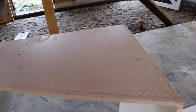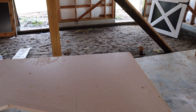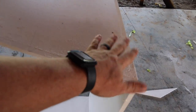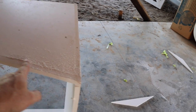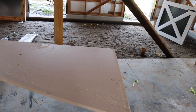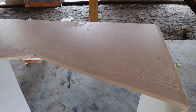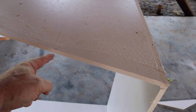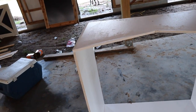The guys didn't really know how to use a speed square, so they went old school — and this is pretty smart, you can see their lines. He asked me, 'How do you find the pitch on these things?' I said I'd use a speed square and showed him how to find the four-in-twelve pitch angle on it. He said he just measured over 12 inches and went up four. I said well, you can do it that way too — and either way it works.